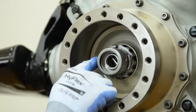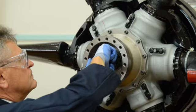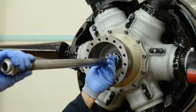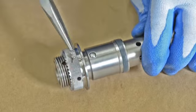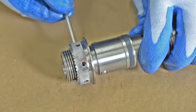Remove the oil transfer tube locking cap assembly by pushing inward to compress the spring and turn the cap counterclockwise to unlock the three tangs. Hold and pull on the oil transfer tube to remove it from the propeller assembly. Some operators store the transfer tube in the assembled condition, or you can remove the cotter pin, headed pin, and adjusting nut from the oil transfer tube. Discard the cotter pin and store all other parts for future inspection and further use.